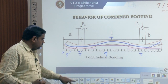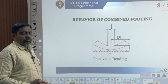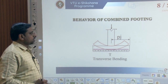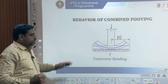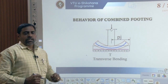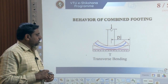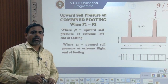With this we have understood the flexural behaviour of the combined footing in its longitudinal direction. Now let's check the transverse direction. In the transverse direction, either at column A or at column B, the footing is going to behave as a cantilever beam. The free end is going to be lifted up from the extreme end to the other extreme end. With this understanding of combined footing in both longitudinal and transverse directions, let us further focus on how it has to be designed.